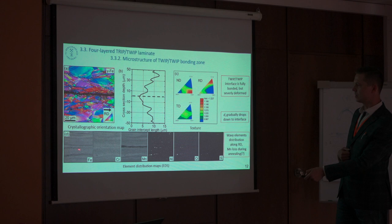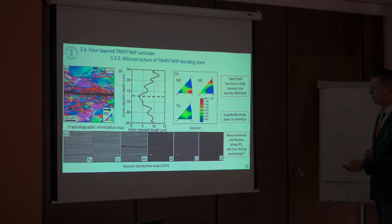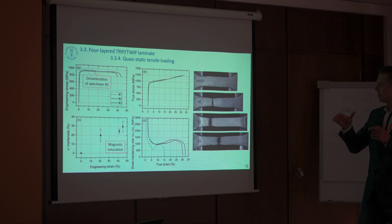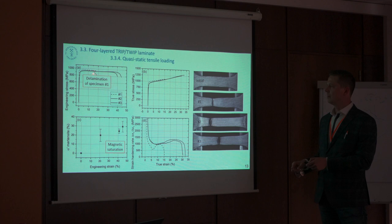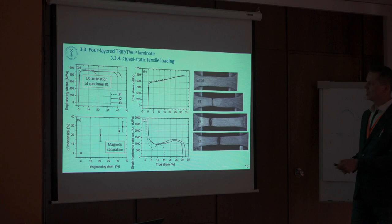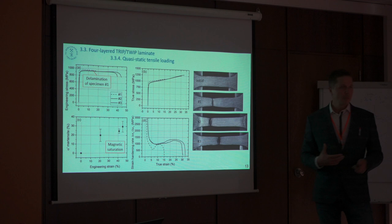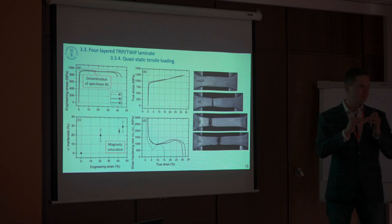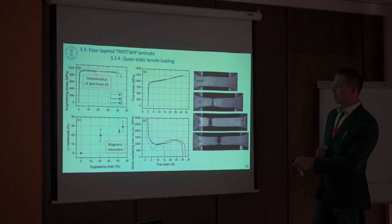Here is the iron map, for example, and there are no voids. These are the tensile experiments: two of them were perfectly bonded until the very end, until fracture. We intentionally kept one specimen which delaminated at an early stage. This delamination in this kind of material is critical — even though all the layers were not individually damaged, they delaminated and were then acting alone, resulting in elongation of only around 15–17% before failure.